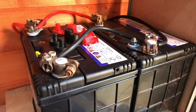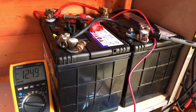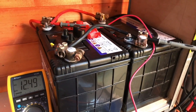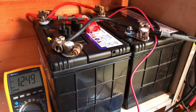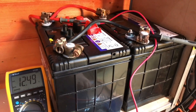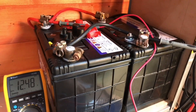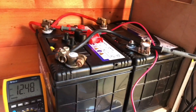I'm really struggling with their voltage level — there we go, 12.5 volts — and there's a bit of sun on those solar panels at the moment, although they are still covered in a layer of frost. These batteries are getting down to 12.1 or 12 volts overnight. I don't think they're holding much capacity now. Whether that's partly to do with these corroded terminals and perhaps this cheap jumper cable wire I've used to interconnect them and connect through to my solar charge controller.